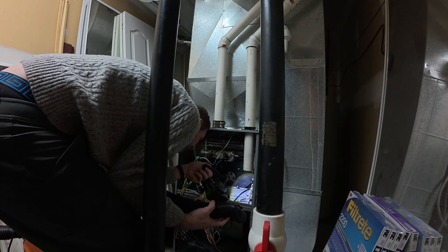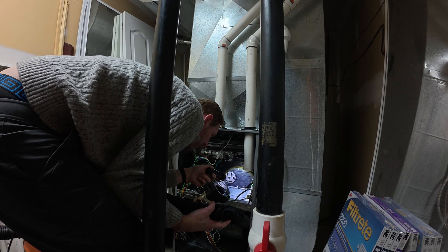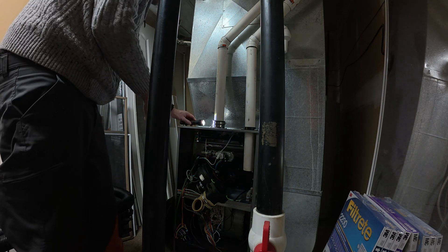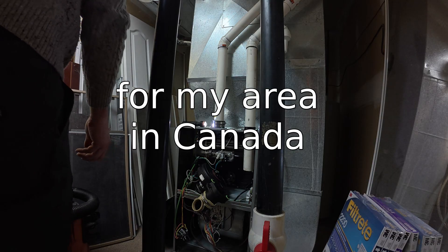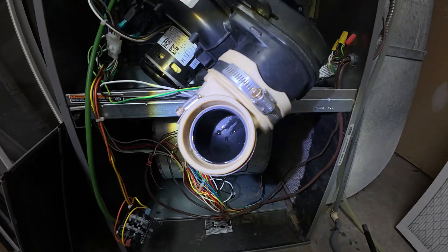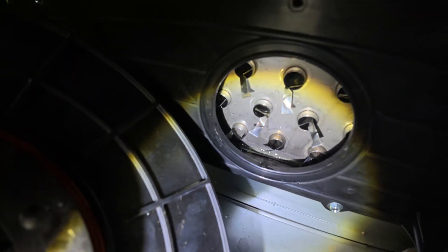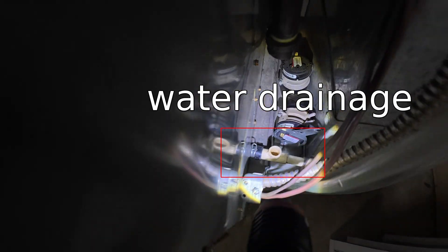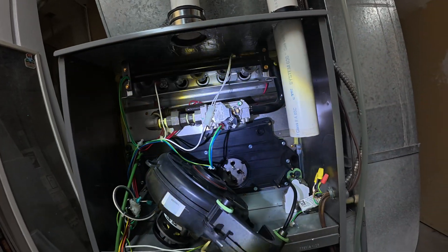So I may have to once a year get my shop vac and suck out all the water. Best case, it happens every three to five years during a really wet time of year when the furnace is working hard. You can see in the video I'm showing how I cleaned it all out — no more water in there. In the back of the motor there was a lot of water; I could hear it sloshing when the motor turned on. I sucked it all out with the shop vac. The clear hose is the new one the furnace repairman installed last year, and you can see the exhaust port as well.